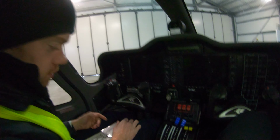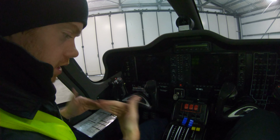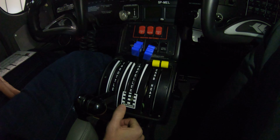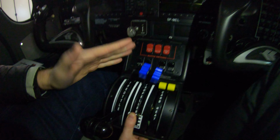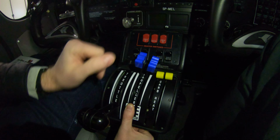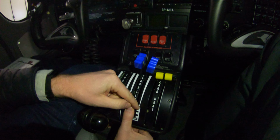So you want to make sure that the constant speed unit in your propeller is functioning properly and the pitch angle is changing. So first of all, you put your thumb here as a safety, so you don't move into the feather range, because you're going to have problems. Reasonably quickly, you decrease your propeller from 1650 and look for an indication. Max indication would be approximately 400 RPM. Wouldn't let it go any lower than that. Once you see that, you quickly return your propeller forward again. You repeat it for both engines 3 times.